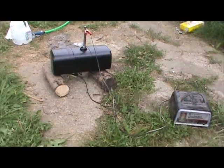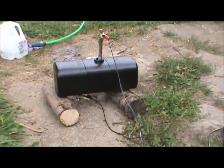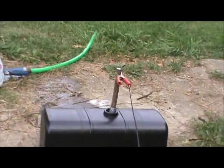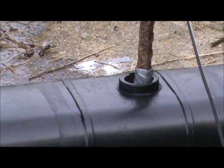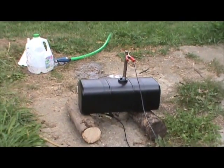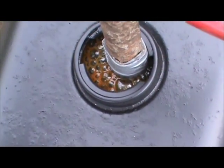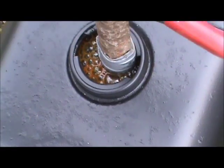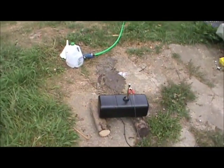Here's the last step I'm taking to clean up this tank — trying to clean the rust out of the inside through electrolysis. You can see I got my battery charger hooked up. I mixed up my fluid and filled the tank with it. The tank itself is grounded and I have this piece of rebar on top that's positive, acting as my sacrificial anode. There's duct tape on the edge by the mouth of the tank and at the very bottom of the rebar so it's not grounding out to the tank — it's a separate circuit. I've only had this hooked up for a couple minutes and the water in there is already picking up a really bright orange rusty color, so it's pulling the rust off the tank already. I'll let this go for a few hours and come back to clean it out. This should work really nice and get all that rust out of there.